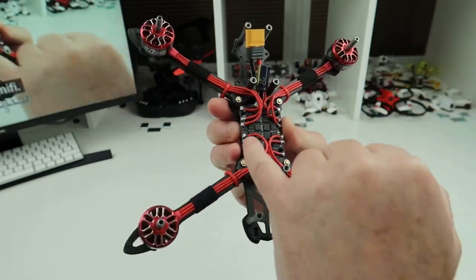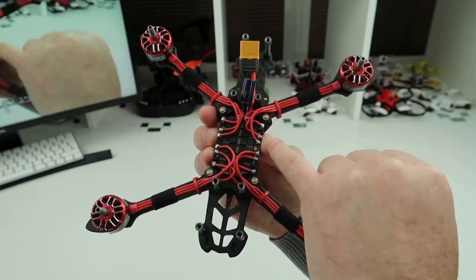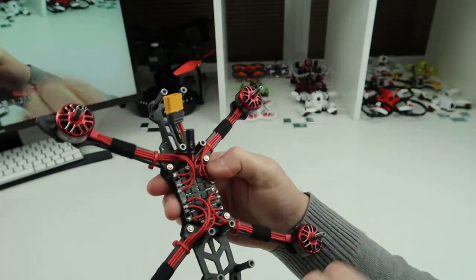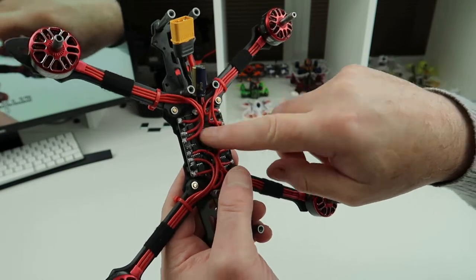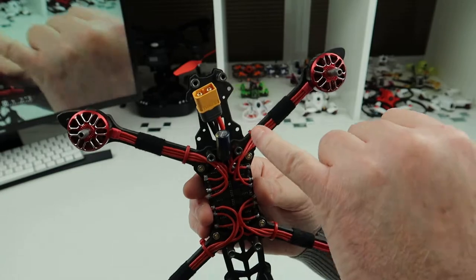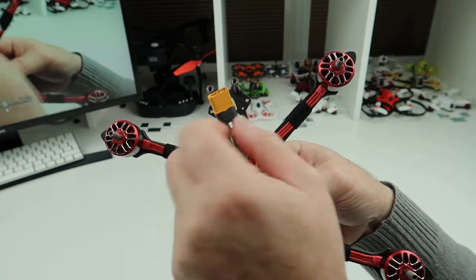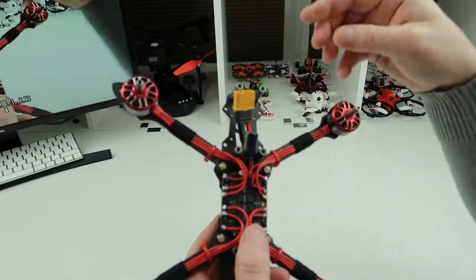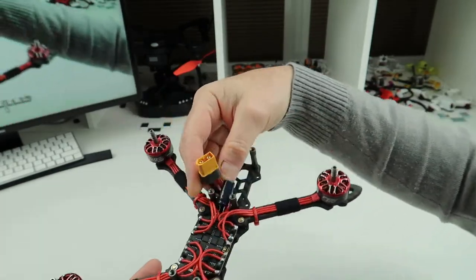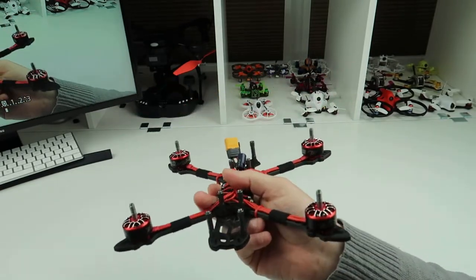Motors are all on and soldered up. I'm not the best solderer in the world — just make sure you get your joints nice and clean and give them a little tug when you put them on. Don't be afraid to apply a bit of heat. I've brought the motor wires round and put some cable ties on there to keep the motor wires straight as they come through the frame. I've put the XT60 on the end of the cable — I prefer the ones with a shield on — and I've made the wire just the right length. I've also put the capacitor on, so now we're ready for the board.